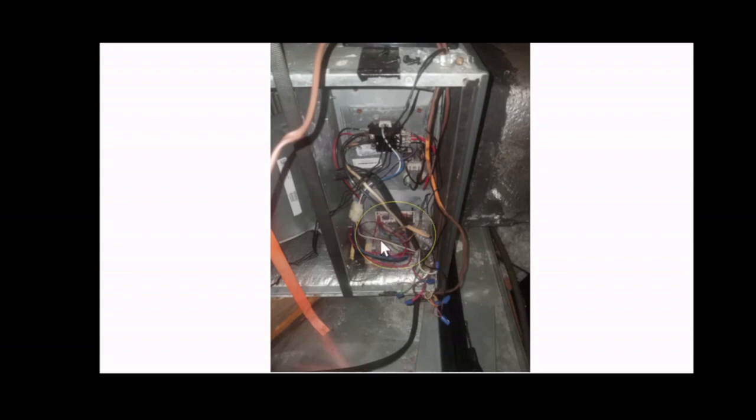So if you need to take some clamps off, any straps off, if you need to untie zip ties or cut zip ties or any kind of fastening device, make sure you do that so you can spread the wires. Make sure again that there's no power anywhere here, and you spread the wires and inspect them one by one. Make sure everything's connected as it appears it should be connected. Of course, if you can find a wiring diagram using the model I provided, it's even better.